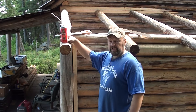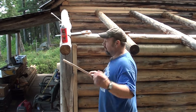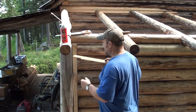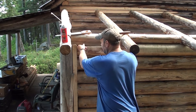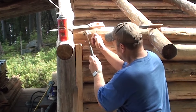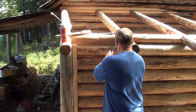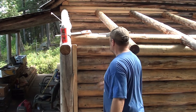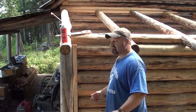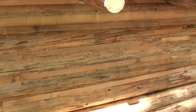The cabins I've fixed up here — we fill all the cracks with Great Stuff foam. You shake it up before you use it, fill the seam, and then put a piece of trim over it. You don't need to use a lot of that stuff — it really expands, just enough to fill your seam. Anything that comes out, most of this stuff is probably going to come out on the inside anyway. Before I finish the inside I'll just cut it off with a utility knife. Nail the trim into the log underneath — you get a nice tight seam. That's all there is to it.